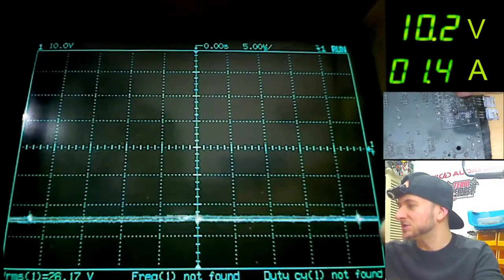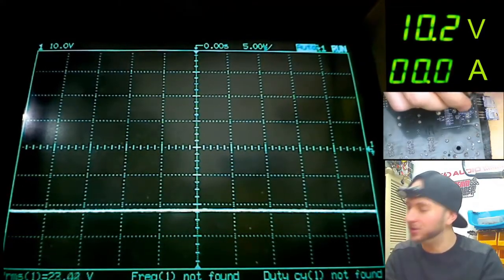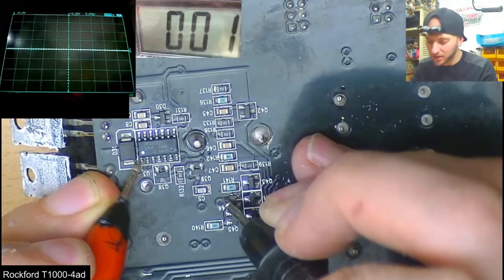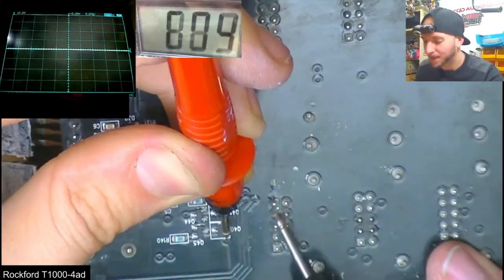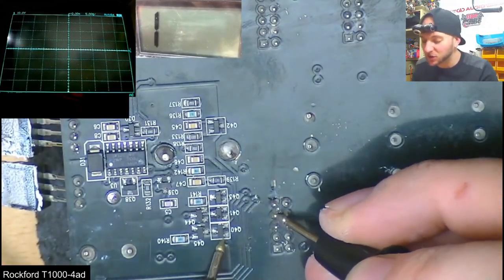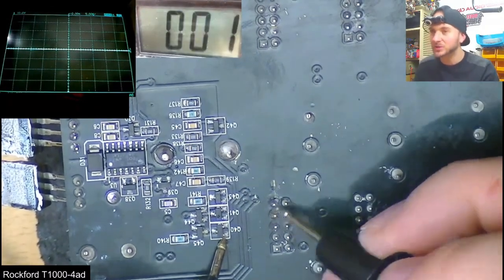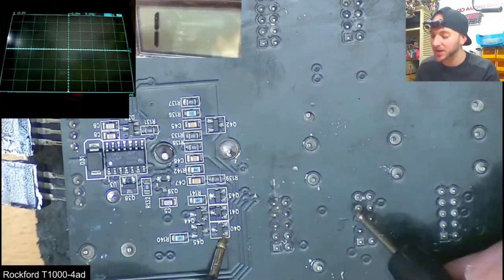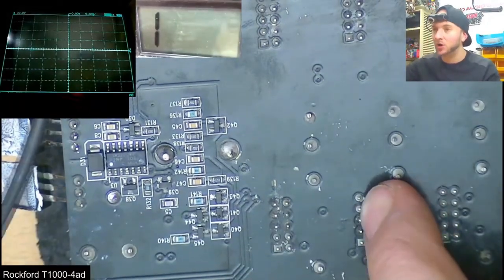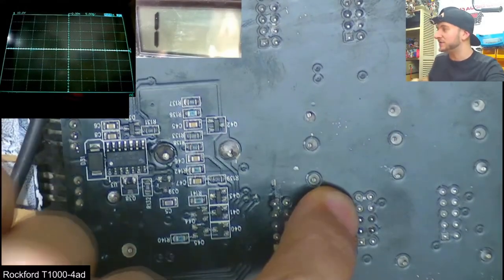The input signal just bumps up, telling the driver to turn the low side on fully. So I traced this pin back to see where the pulses originate from, using one of the good channels as a reference, and found that it comes out of one of the pins on the upright daughter boards. Q40 has continuity directly to one of the pins of the driver card.